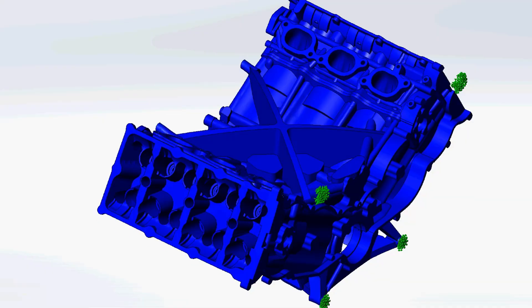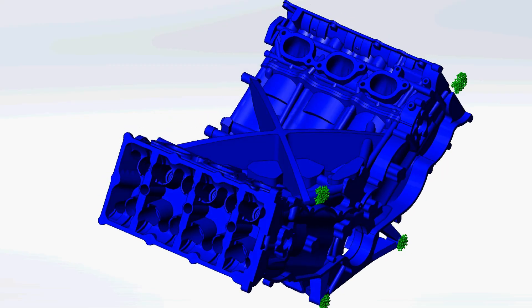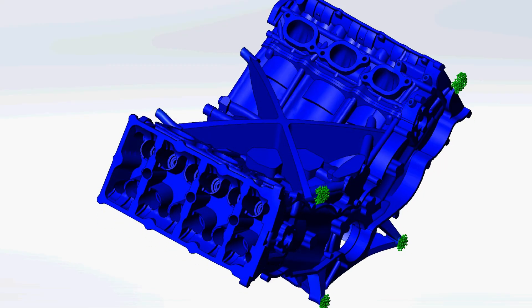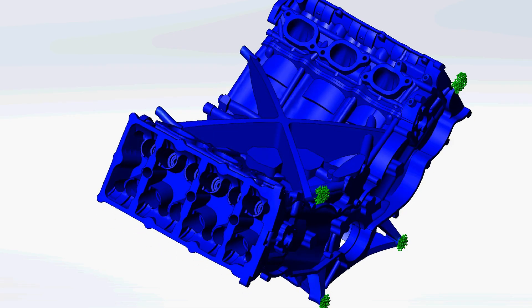It has some naive placeholder engine mount designs. Our load case here uses 10 kilonewton-meters of torque and 10 kilonewtons of bending load. The color scale is fixed with red at 400 megapascals and a displacement scale of 880. As you can see, there's barely any stress at all — it's around 20 megapascals, so it doesn't register in this color scale. Very low load.